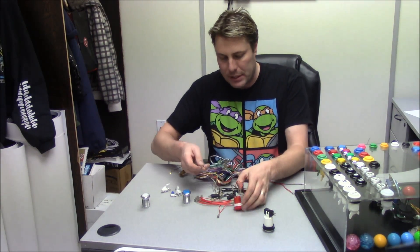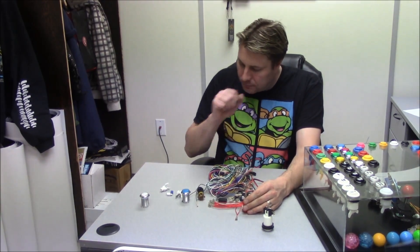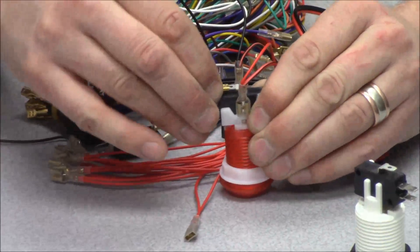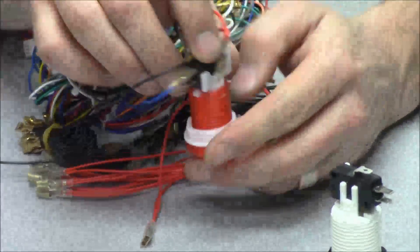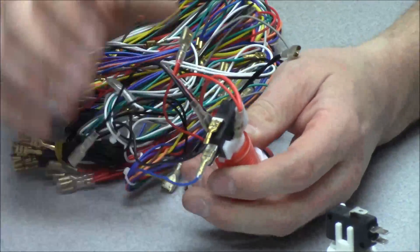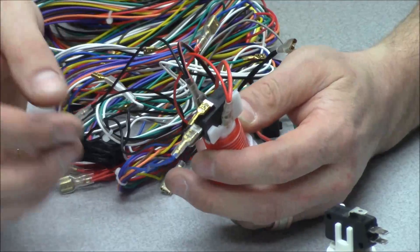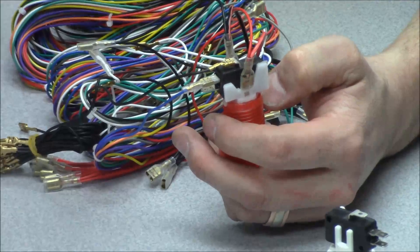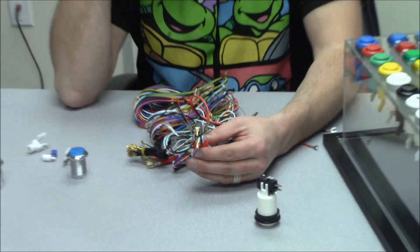To give a quick visual of what it looks like connected: you put your active wire going to the second prong, and your first prong underneath is always your ground. Then you daisy chain that ground to every other button. All your buttons should look like this. You can see right away just from a couple of wires how this can get messy and complicated quickly. If you do it one step at a time — all your color-coded lines first, then your daisy chain ground, then your LED harness — you should be fine.